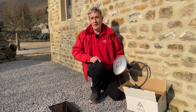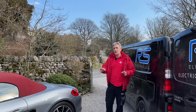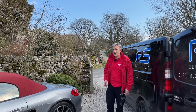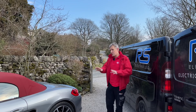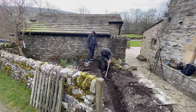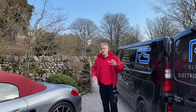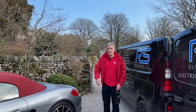The advantage is you can also have Wi-Fi in the garden. The solution for this installation is that it's going to need a new cable pulling into the garage to feed the EV charge point - a considerable amount of work given it's a detached building with existing paving. Ross from RS Electrics is already beavering away digging the trench, and we're also going to put an external distribution board near the meter enclosure to feed the garage itself.